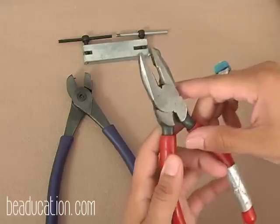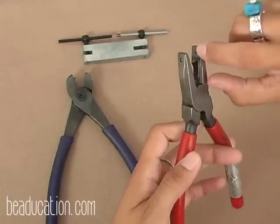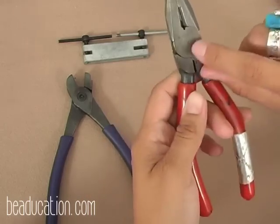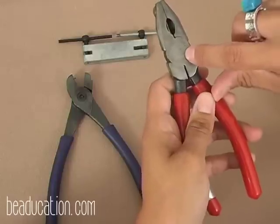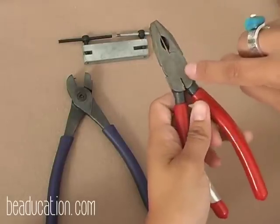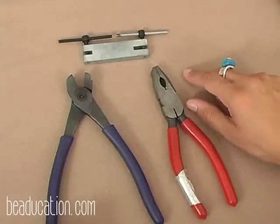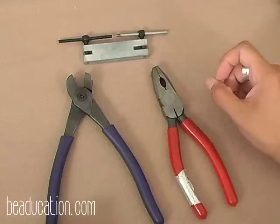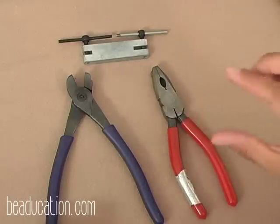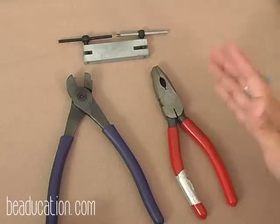This tool is called a metal hole punch or handheld hole punch plier. It has just one bit — it punches the metal through on this side. If you look closely, you'll see a number one marked on it. These come in different numbers. Number one makes a 16-gauge hole. They're handmade and go all the way to number four, which is about an 8-gauge hole equivalent. So it goes from a really small to really large, but you only get one hole size per tool — you'd have to buy a different tool for each hole size.